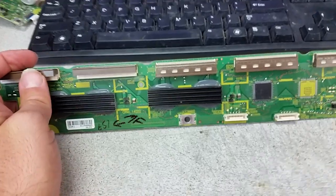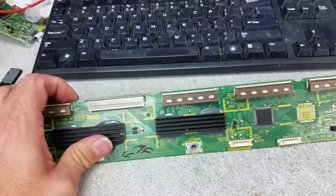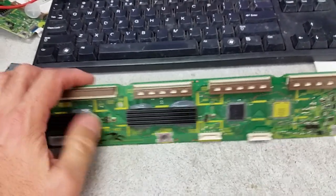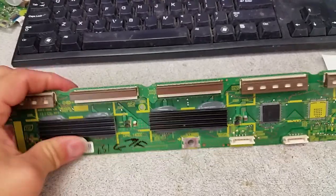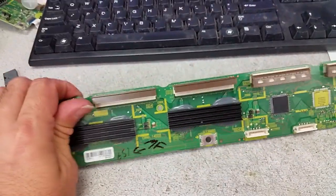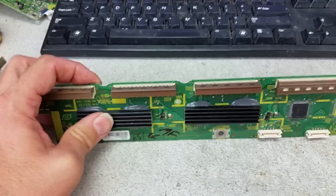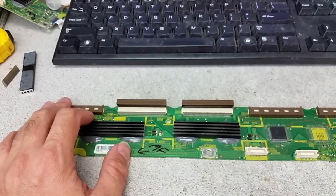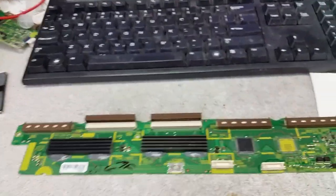So what is happening is, every single horizontal line in the panel, which is a matrix of horizontal and vertical lines, all the horizontal lines are being engaged with a sustain output voltage, which is a high voltage, so many times per second, and however many times they are being engaged, that is, however many times the voltage is being set up per second, that determines the color of the individual pixel, in combination, of course, with the vertical line. So what this board does is, so many times per second, it sends either high voltage or no voltage, and in some cases negative voltage, in order to clear up the screen, but that doesn't really matter,